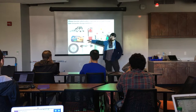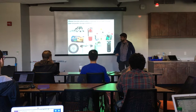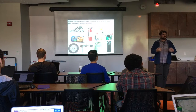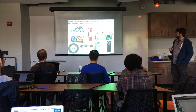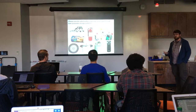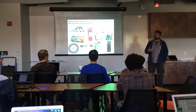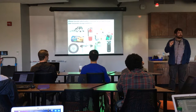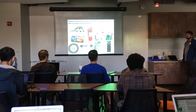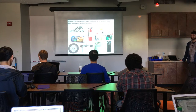Obviously things like pressure cookers and car tires, Pillsbury Grands biscuits — how many people have jumped when you open that and release the pressure. One that very few people think about are instruments — things like seismometers. Anything that you have an instrument in a case, if you seal it to be weatherproof or dustproof, you've made it a pressure vessel — you're trapping atmospheric pressure inside. If you put it on an airliner for transport, or if temperature changes dramatically, say electronics heating up, you can get pretty large pressure differentials that can even extrude the O-ring out. All pressure vessels need some way to vent. A pressure differential probably means it's leaking a little bit, which will have an influence on the sensor signal.